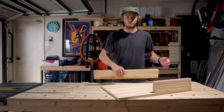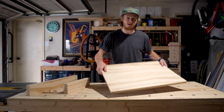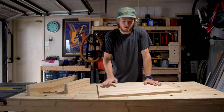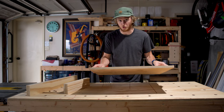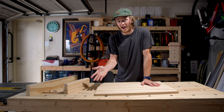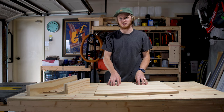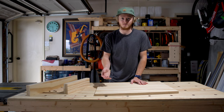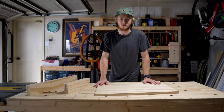The whole thing can be made from plywood, but there are a few other material options. For your base, you want something that's going to be flat and smooth, and considering the size, plywood or MDF are going to be your two most viable options. This is a piece of three-quarter inch plywood, and that's just what I had on hand left over from other projects, but I think half inch material is the best. There are two reasons why: the whole thing is going to be lighter, and you're going to have a quarter inch more on your maximum cut height you can do with the sled.